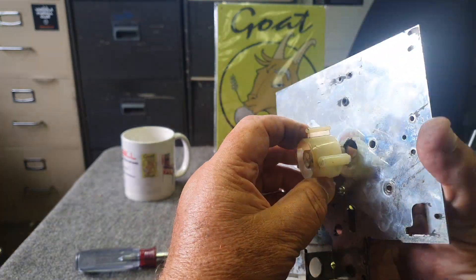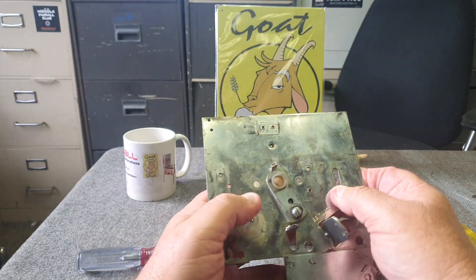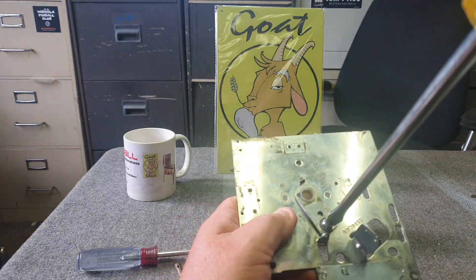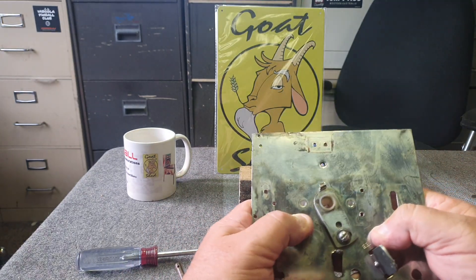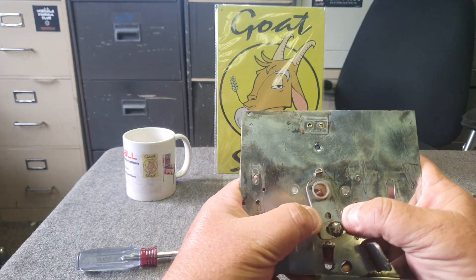All I had to do to fix it was loosen the zero stop position screw, just marginally move the bearing, turn it round, and pop it all back together. Pop it in like that, then tighten it up. The idea of the zero stop is that once the bearing is in position, that zero arm will pivot on the bearing.